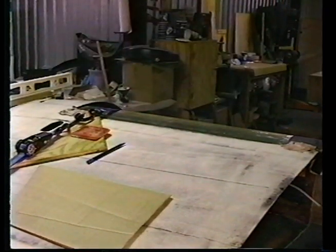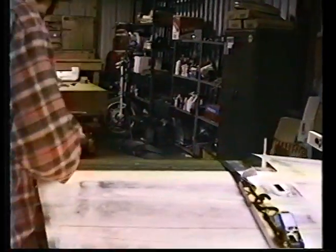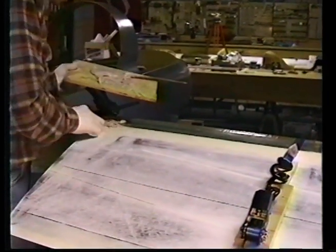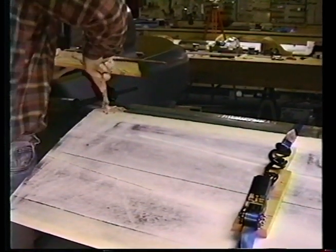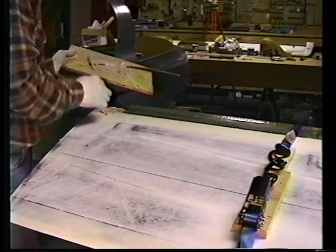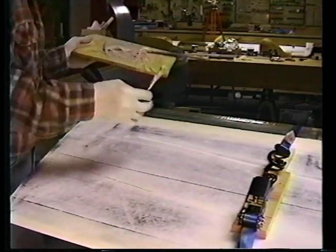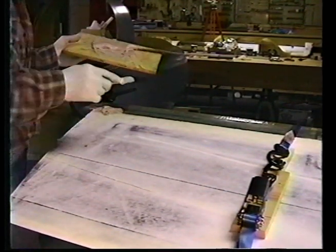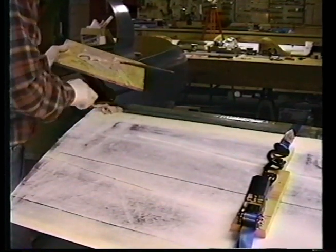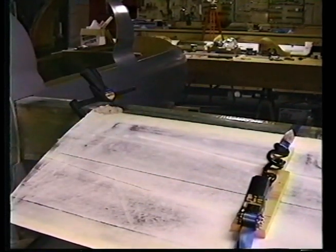I'm going to go to the opposing side. I do it in 4 points. But I'm going to get the easiest ones first. I've lightly sanded the areas where I want to make sure I have good attachment. I get a little bit down between the two to handle shear load when I put the weight on it, because I am going to take the supports off of the aircraft that are holding the wings up. I'll leave the straps on here, leave the clamp on, but out at the outboard ends of the wings where I've got foam and such, and these tables underneath, they're gone. I want to make sure that the airplane has a tendency to sit level of its own accord, not warp into position.